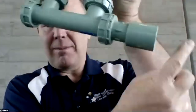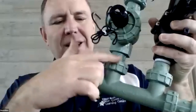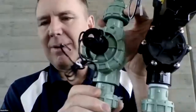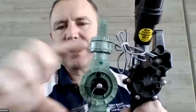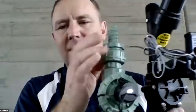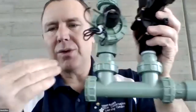This is a valve manifold — the main line comes in and feeds multiple valves. Pre-made manifolds have union connections on each side of each valve, so you can simply unscrew the union and slip the whole valve out of the assembly without cutting pipes or digging. This makes maintenance so much easier. You can get manifolds with two, three, or four valve positions. If you're building your own system, use a manifold; if your existing one is working, don't redo it unless you have to.